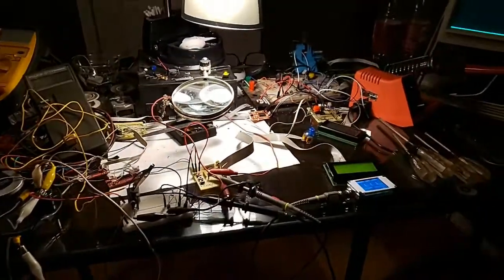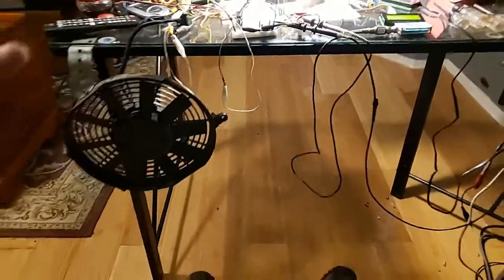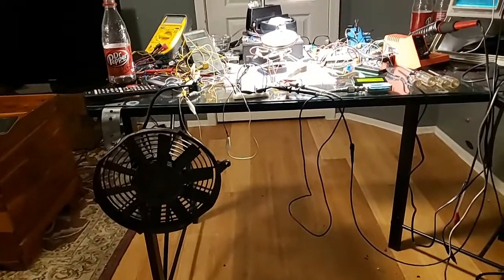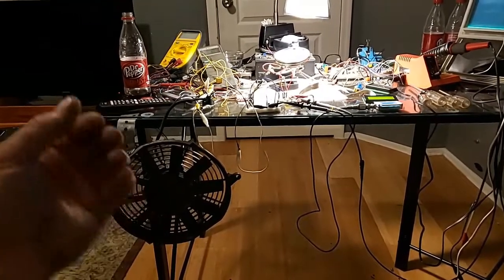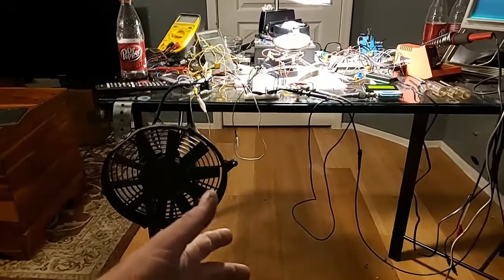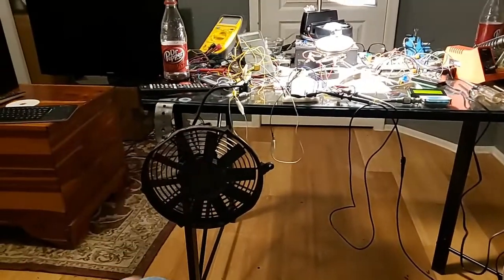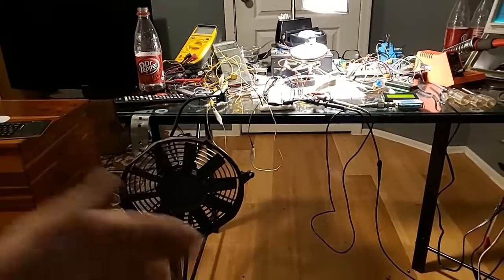I might make a little controller for my latest Mustang project — the electric fan. I noticed that the controller must have burned up because somebody had a relay and some wires ran across it to the battery. I could replace the relay module — it's not discrete parts, it's actually a whole box that has the fuel pump controller, the radiator fan speed relay, and a bunch of stuff in it. But I like how the newer vehicles will actually ramp the fan up and down with temperature and have a soft start, instead of just on or off or just a high and low speed.